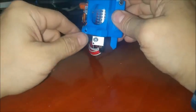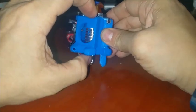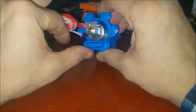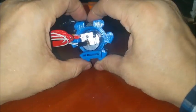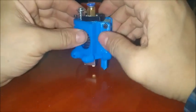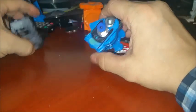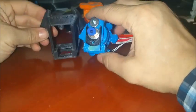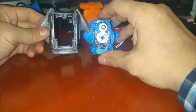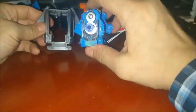Regardless of how optimized I have this, I'll always be left with this amount below my effector, which is still much better than the inch and a half for the J-head heat sink you normally have below. The second thing is I've used the smallest effector possible, giving us optimal print area in x and y. This thing is very compact — here's the standard one that comes on your new Kossel Minis, the Micro Maker and the new Anycubics.